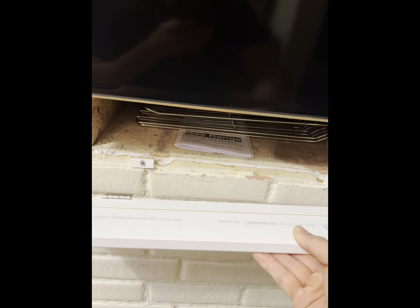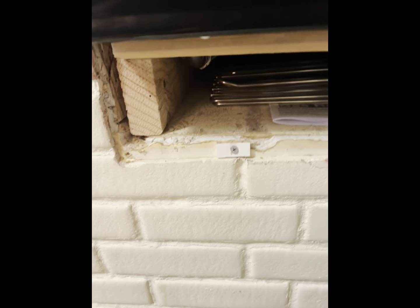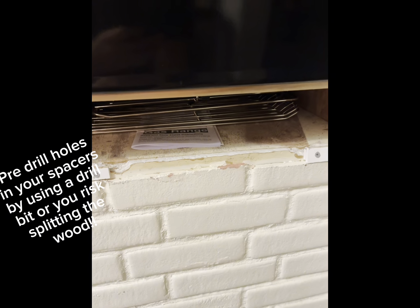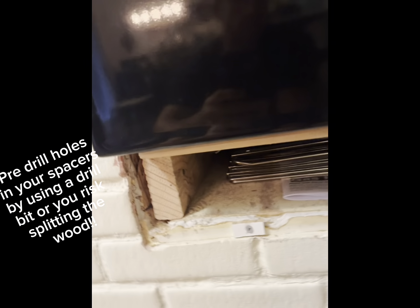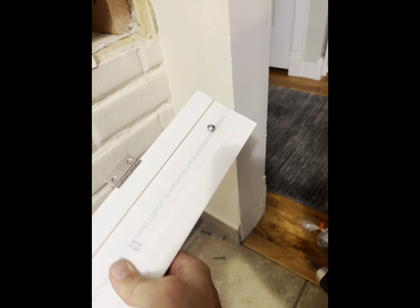So home products are a pain in the butt because of things like this. So I have to make little spacers. With this, the extra wood that I had from the top piece, I made 2 little spacers that I'm gonna need so that it can open at the hinges. So as you can see, the trouble I ran through, I had to make 2 little spacers, and I attached the hinges right onto there.